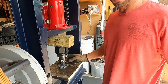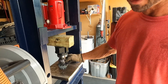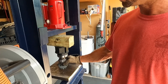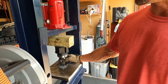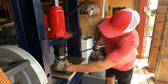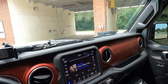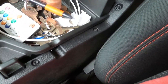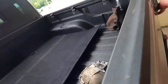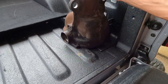We've got our stuff stacked up — bearings that we're not going to use out of that kit. The most important thing is making sure that I strip the cage off of this bearing so that I know I'm not putting pressure on the cage; we're only pressing down on the center of that bearing. I do realize that I pressed this race in and these bearings in before I washed this thing, but they'll clean super easy.